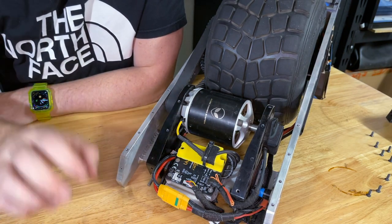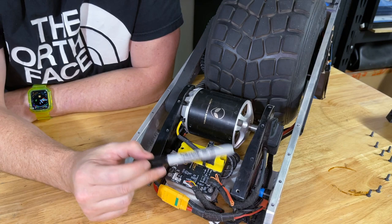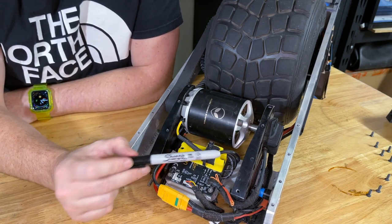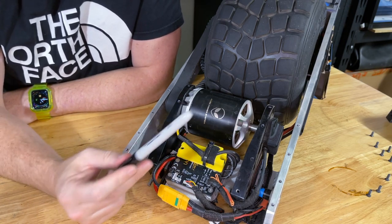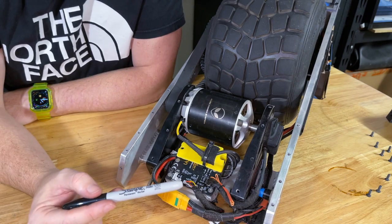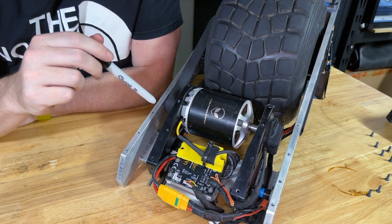The sensor cable runs around the outside to another little box containing an AS5047 encoder — basically a chip that picks up the magnetic field from a magnet attached to the end of the motor shaft. I posted results in another YouTube video on my channel, and it really made quite a big difference to low-speed torque — when you're stationary or crawling along at one to three km/h. Above that I don't think it made much difference, but for scenarios like riding through longer grass I was getting a lot of cogging before, and with the encoder those problems went away.